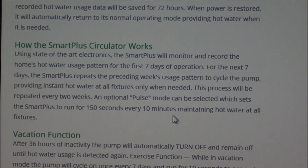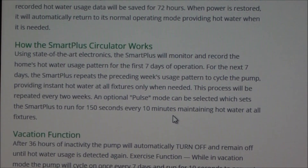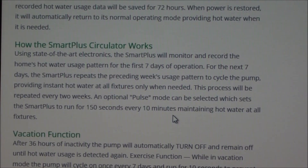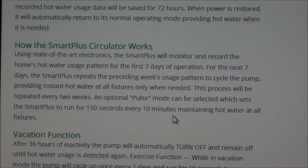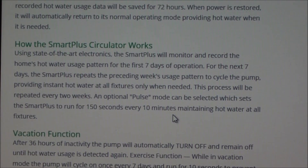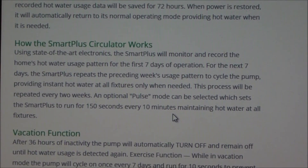So I'm going to buy a very inexpensive timer that's going to do exactly that — allow the pump to run two and a half minutes, off 10 minutes, then back on for two and a half minutes, basically running at a 20% duty cycle all day long. It should save me a little bit of energy in terms of natural gas as well as electricity. And since the motor I have is a permanent split capacitor motor, that frequent starting and stopping is not going to be significantly detrimental to motor life, nor is it going to cause significant inrush current when the motor starts.